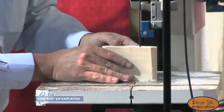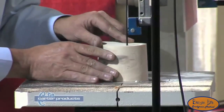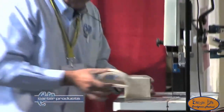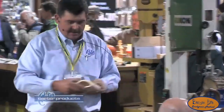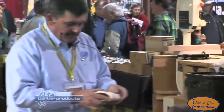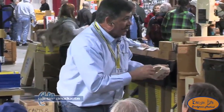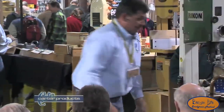We're just going to cut in and around and leave maybe a quarter of an inch all the way around. Now, for the most part, we have already done the full outside of that box. You would glue the back on — don't worry about filling it, actually close it and glue it shut. What that does is it gives you less curve around the drawer so that the drawer isn't so sloppy in the box. The outside, pretty much, is done.